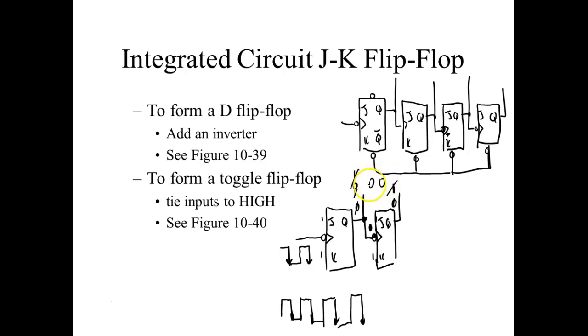Now, if I lay this out backwards, so if this is the least significant digit, and this is the most significant digit, we started off with 0, 0, we went like that, we went like that, we went like that, and then we rolled around with 0. This would be equal to a decimal 0, this would be equal to decimal 1, that would be equal to decimal 2, this would be equal to decimal 3.